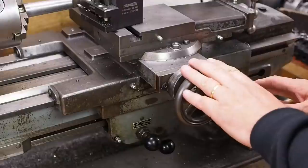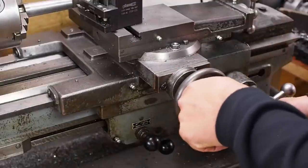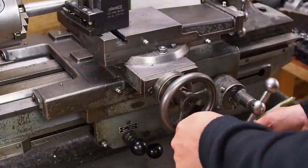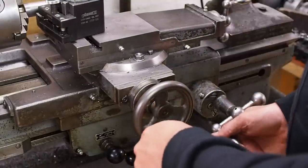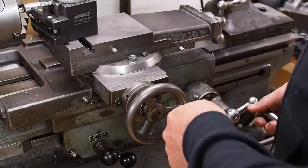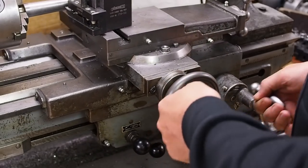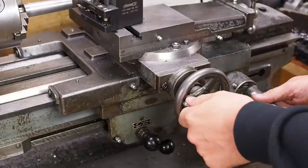With an open loop system, the computer controls the motors, my hands, which are moving the axes, but has no feedback as to whether they're actually doing what the computer's telling them to do. So we send out signals to move just like this, and we assume it happens. If it does, you get a good part. If it doesn't, you find out your part's scrapped.